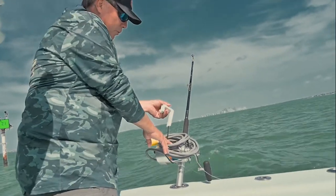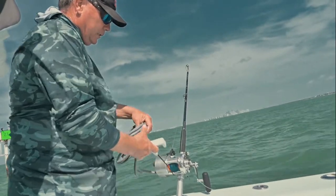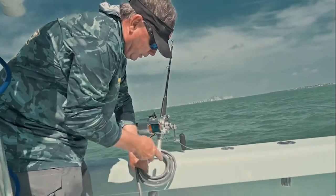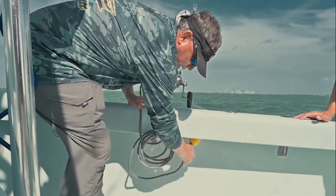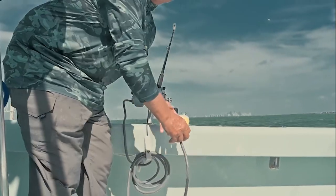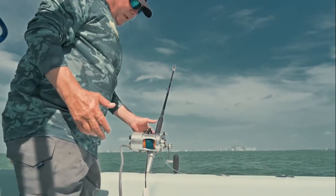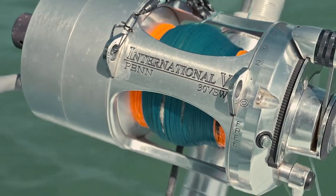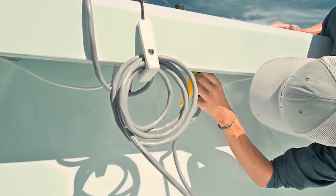The hook seems like it's not a real important part, but it serves a lot of purposes. It helps us organize our cords — not only when you're storing it, but when you plug it in we keep the cord elevated off the deck so you never step on it. If you step on this cord while it's plugged in, you'll break the face of your receptacle. On three occasions on rough days, without this cord the whole electric reel has gone out of the gunnel — if it comes unplugged, it's free willy. That little clip has helped us save a lot of problems.